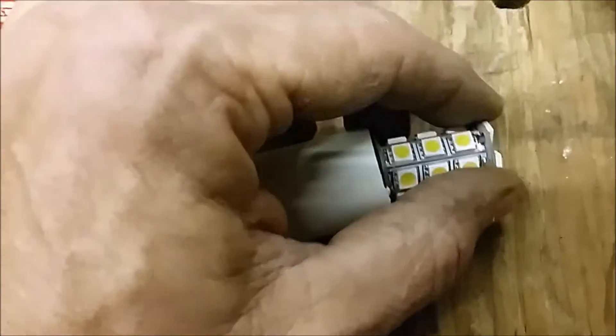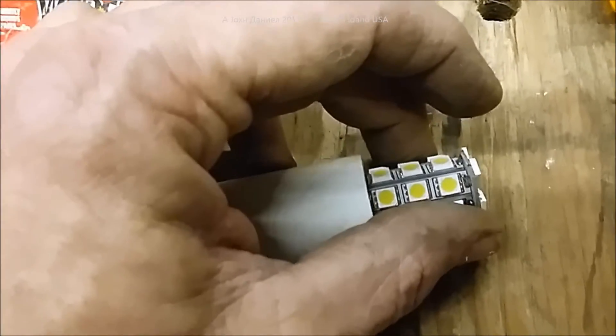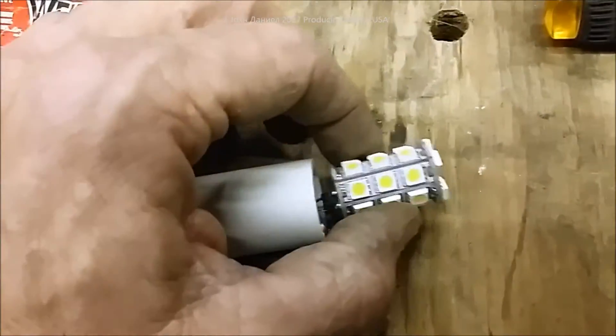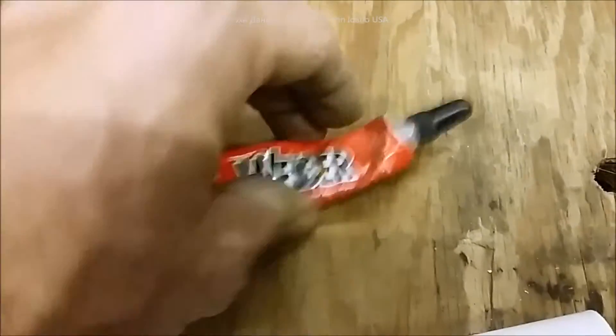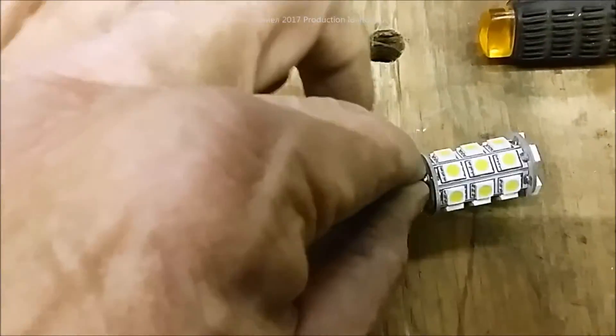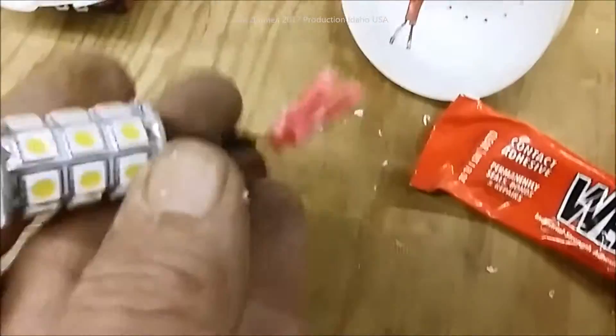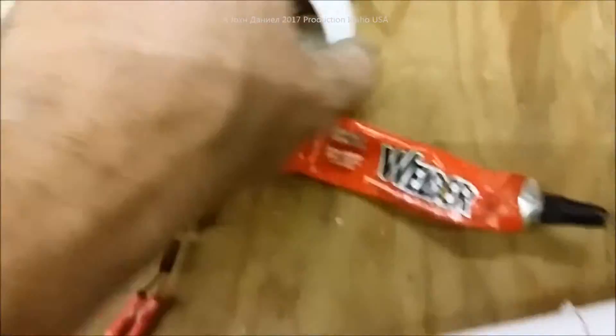Here's the reason I'm using this PVC: the outside diameter of this bulb is exactly three-quarters of an inch, so it will slip in just barely - less than a paper sheet's thickness from being tight. I'll put glue around the whole thing. This is non-electric glue - no current can go through it - and it actually insulates well. I'll gob it on real good, insulate it, stick that in there and let it dry, then crimp the wires and slip it up through.